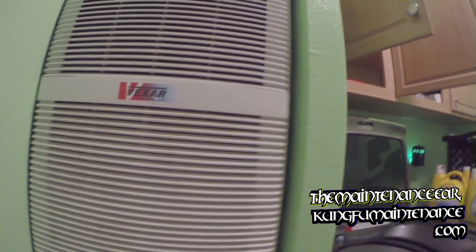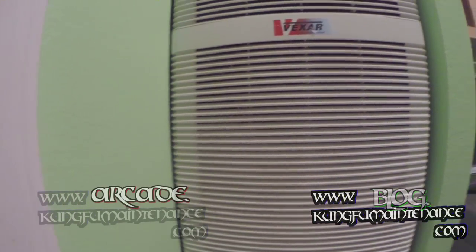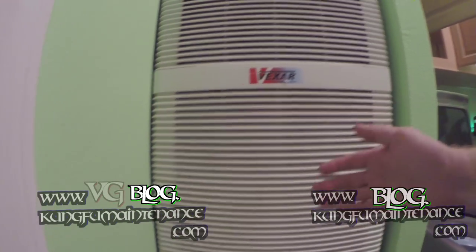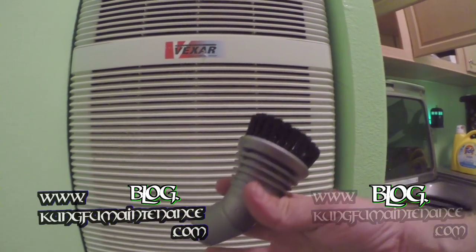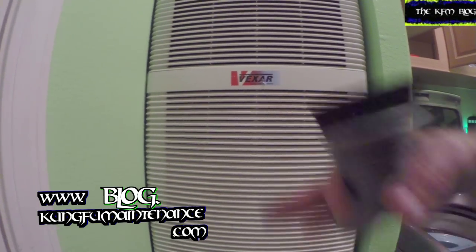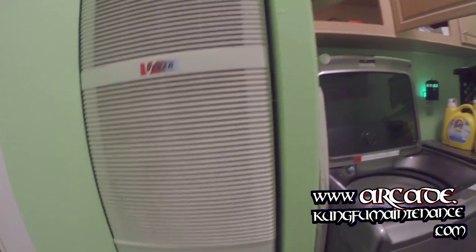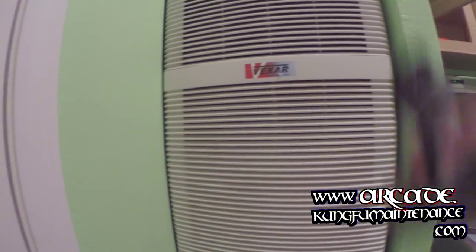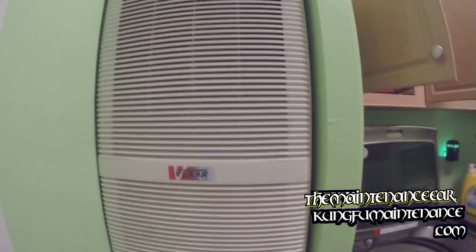Before you change any filter or clean any filter, you can see all this hair that's collected on the grill. What you want to do is turn your AC on, or at least turn the fan on so it's sucking in. Then you can take a dry paint brush or a vacuum head brush and use your vacuum as well, or just knock it off — and all that dust will be sucked into the air filter before you replace or clean it. That way you're starting fresh rather than putting a brand new filter in with all this dirt, because a lot of that dirt will just be brought right into your brand new filter.